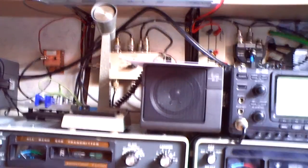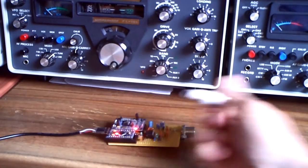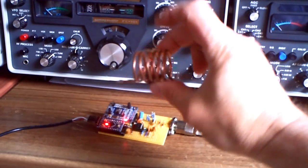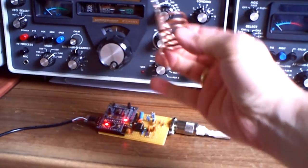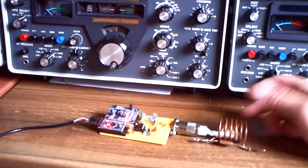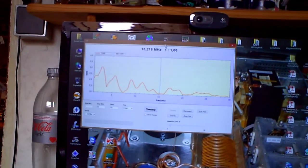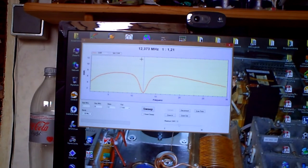Here I have a PL connector with a coil, and I can connect this — I have an LC resonator. I'd like to check on which frequencies this resonator works, so I'll make a loose connection. And then see how it works: wow, there's a dip — a dip at 12 megahertz from this resonator.